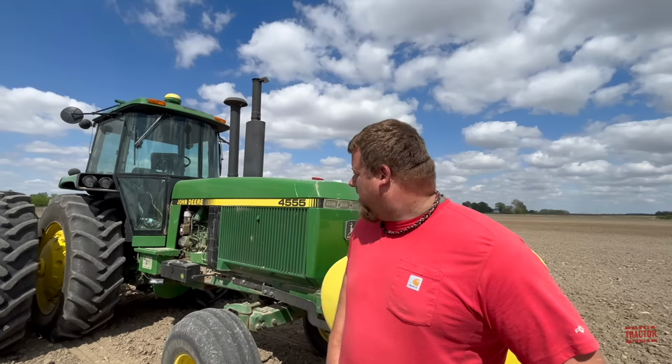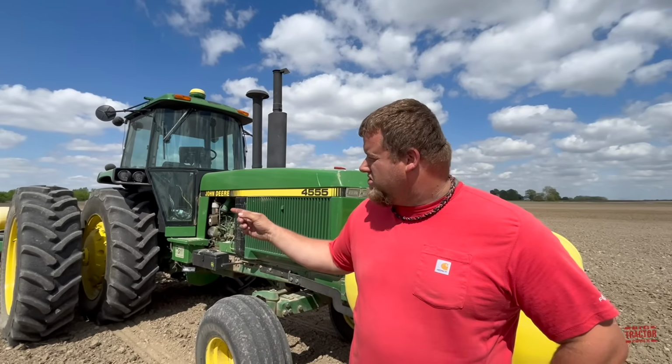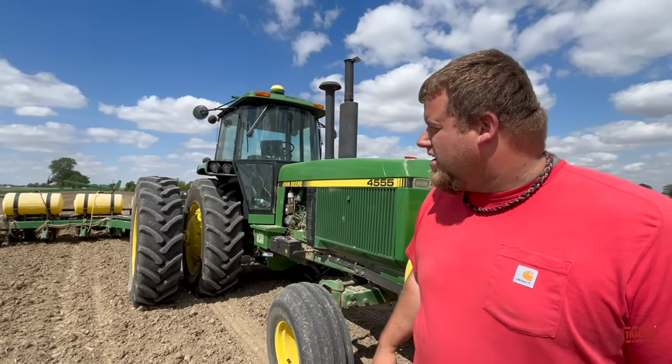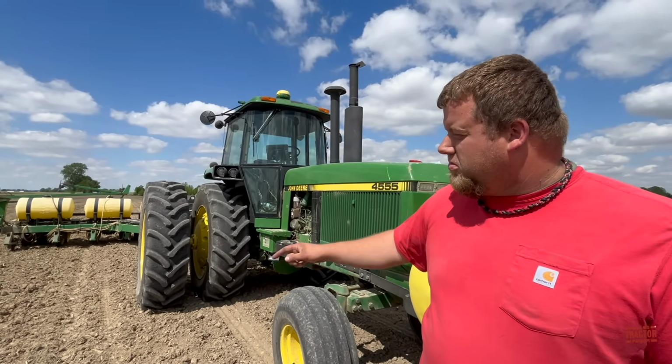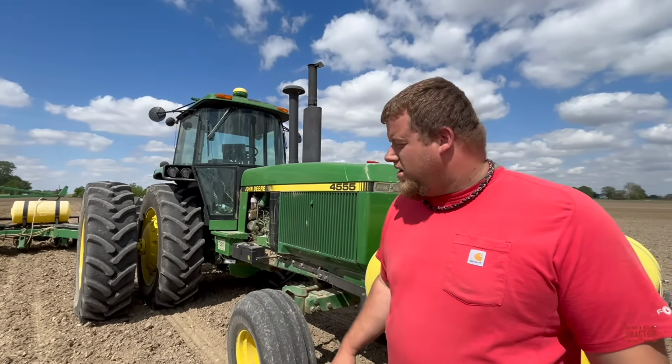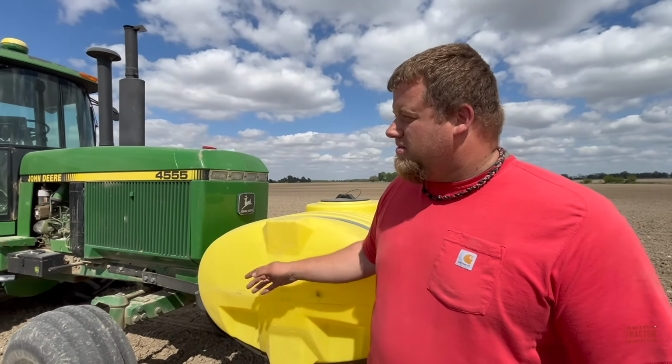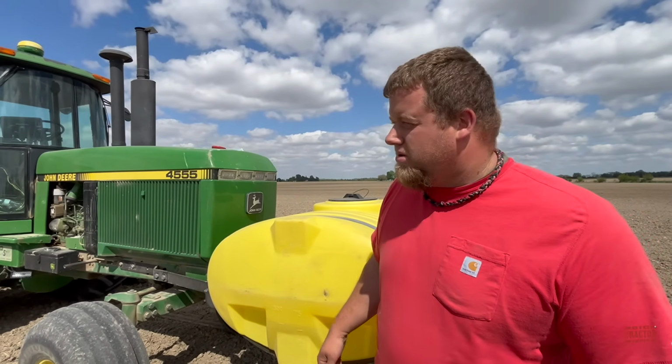Hi, I'm Dane Jessup here in Sheridan, Indiana. First generation farmer, or I guess skip generation farmer, I think is the term that's being used now. I farm about 700 acres here. This has been my planting tractor for going on 3 years now. I've got a 12 row 7200 planter. I run 28 in sulfur, 2x2. And then in the furrow, I run Ag Spectrum product. I'm an Ag Spectrum dealer. P&K and some micros I'm putting in the furrow.